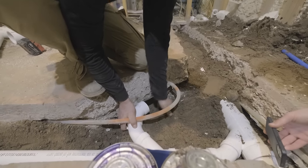You might be wondering why I have two different length trap arms — I don't know yet if they'll select a light fixture centered between both sinks. If they do, the electrical box for the light fixture will still miss this two-inch vent. Whether they do a fixture centered on each sink or between them, my pipe won't be in the way. That is one of the most common things an electrician will get upset at a plumber for — putting the two-inch pipe right on the center of their light fixture so they have to use a shallow box. Also, the vent for this bathroom goes into the attic — you're either tying into another vent or running a new puncture through the roof with a roof flashing. You want to tie into an equal or larger vent when adding a bathroom like this.